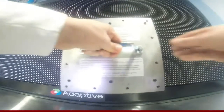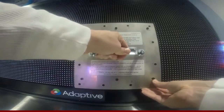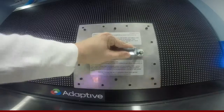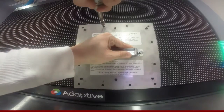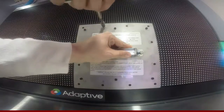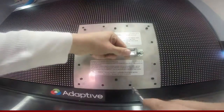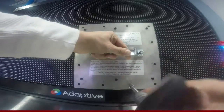Take the module replacement guide and place it over the driver board that you want to remove. The holes in the module replacement guide will line up with the holes of the driver board. You then take the torque wrench, insert it into the holes of the module replacement guide, and they should go into the holes of the driver board. Then just start unscrewing in order of the numbers written on the replacement guide.